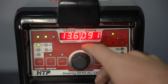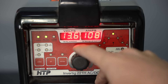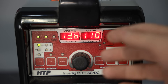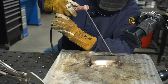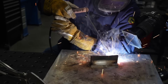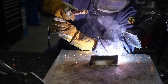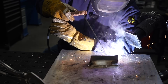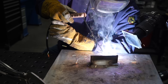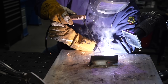You can look up charts with the amperage for each electrode, or find it on the package. About 110 amps is going to be pretty good for a one-eighth inch 6013. One thing that's really nice with 6013 is it's pretty easy to strike an arc compared to other electrodes — not that it can't still be a frustrating experience especially as a beginner, but it is easier, even for a rod that's been welded with before.